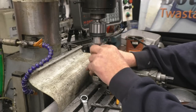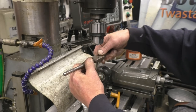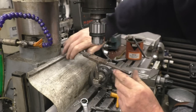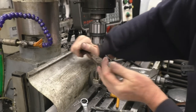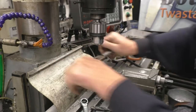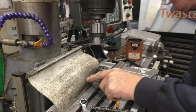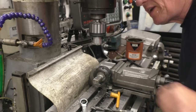It's not a particularly sharp tap but it certainly appears to be doing the job. It hasn't got a little dimple in the end — normally taps have a little dimple so you can put a centre in, but this one hasn't. It's not the best tap in the world and the hole is slightly undersized, but that means it is going to be a nice tight thread. I may have a better tap at work — I think what I'll do is get a better tap. That's certainly started so I can take it out of there, but it has put quite a decent, nice sharp thread in.